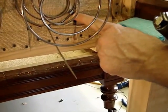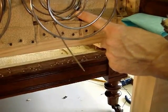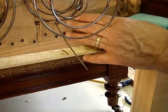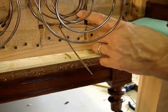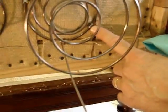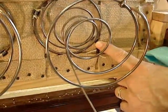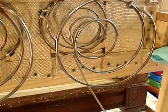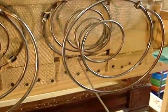I've cheated a little bit because this is not what an upholsterer was able to do back in the 1870s or 1880s. They were having to either position them by hand and then lash them, or find some strategy to pin them. So I've just set these to keep the springs in position, but I don't want to leave them in because it's not traditional upholstery. It gives me the opportunity to just keep the springs in position while I do a traditional hand lash. You also don't use this in conservation when you have old webbing and you are doing a museum piece.